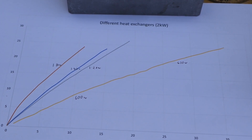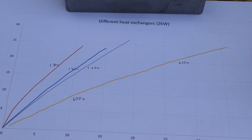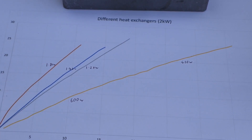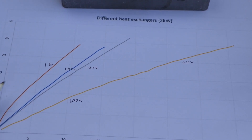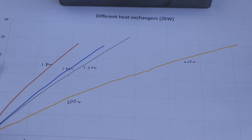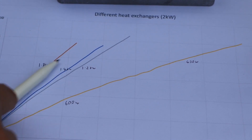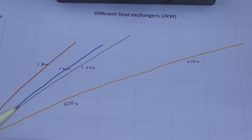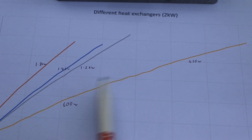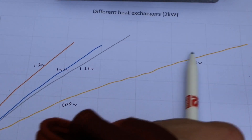So let's take a look at the results. On this graph we have our increase in temperature from our starting point, which was typically about 15 degrees, just normalised so we can show them all from the same point. Across this axis we have time, and then on the four lines we've got our three recommended heat exchanger combinations and the experiment we've just done. Starting from the fastest heating with the bumper heater, we've got typically 1.8 kilowatts of water heating between 0 and 25 degrees increase in temperature, finishing up about 40. From the big heat exchanger we ended up with 1.4 kilowatts and from the basic around 1.2 kilowatts. The heat we managed to recover from the exhaust was typically around 600 watts. But as the water warmed up and we got past 20 degrees above ambient — so 35–40 degrees — the efficiency drops off, and we typically recovered about 400 watts.